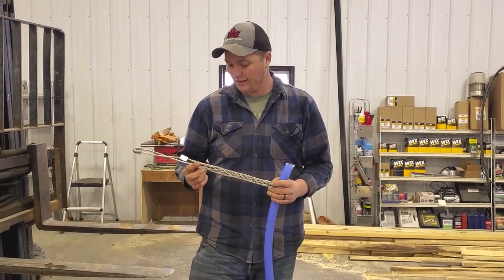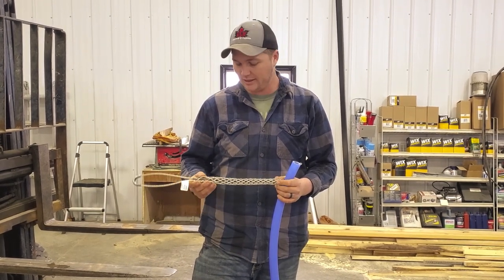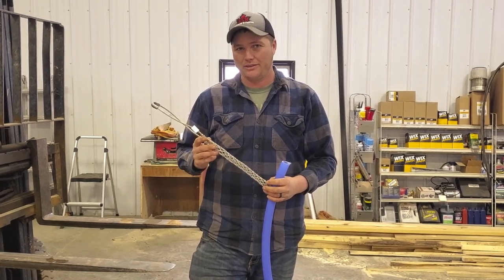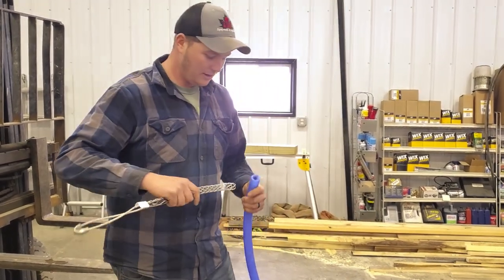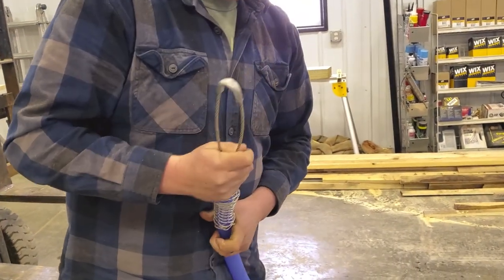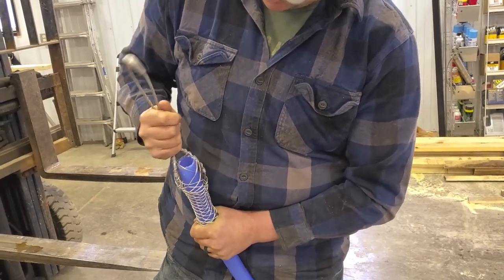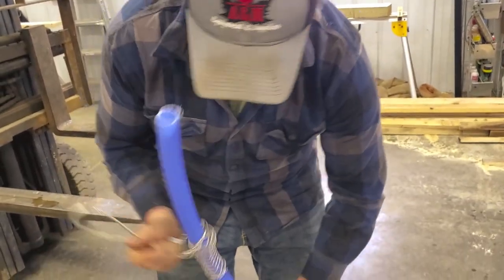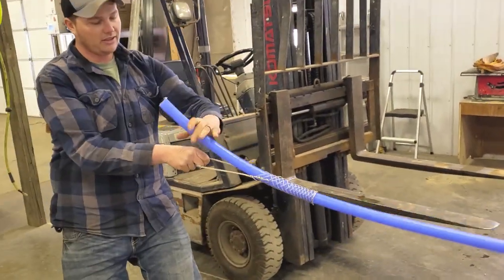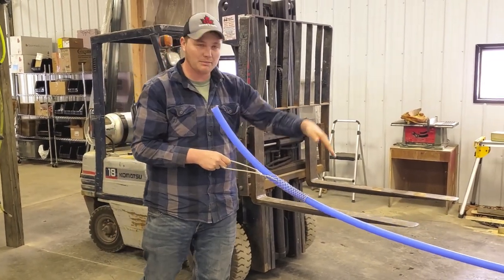I wanted to show you guys today a good way to replace these. These are tension grips. They're made out of stainless or galvanized, and they're about $23 for a 1-inch. Typically, you slide them over your pipe. Get this all the way on there, so it slides all the way over your pipe like this. And this keeps tension on your main line so you don't get slacks and bubbles.